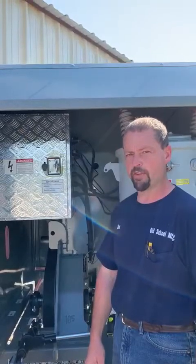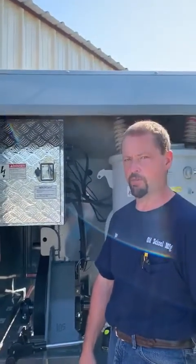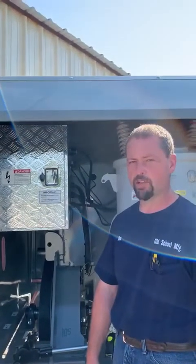I'm going to discuss a problem that we have had with a false temperature reading on your monitor. Number one, if you've been pulling in heavy weeds and the generator has been working hard, this is not a false temperature reading. You're overheating the generator. Please follow the instructions and never ever shut off a hot generator unless it's an absolute emergency.